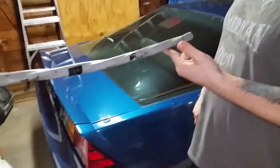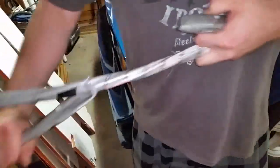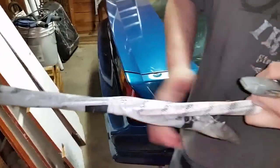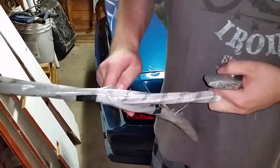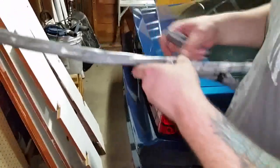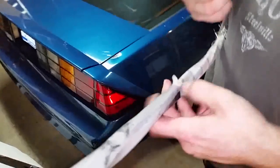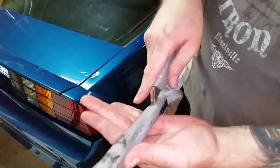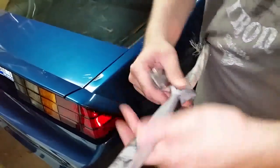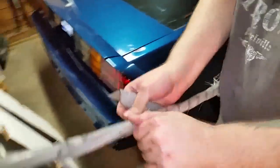All right, now we pulled it through. We're gonna cut it now at the end. In some cases, when you cut it over here, you can just rip it and it'll pull right off. This one is actually waterproof. That's why you make a tiny, tiny incision. You don't wanna go through the casing, through the other casing, so I don't even put pressure on it. I just make a line and it actually cuts it like that. Look, see, pulling it right off. And I'm not even pushing any pressure on it.